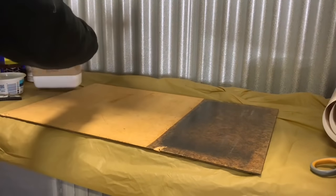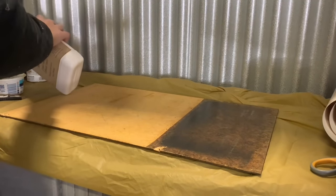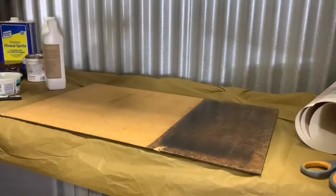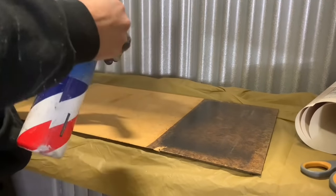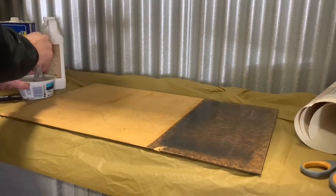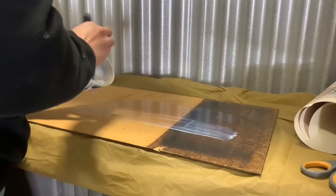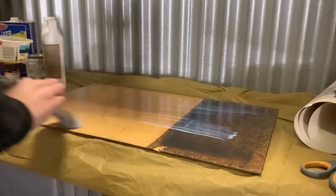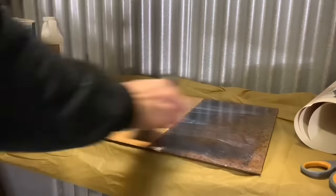I use it with my Chalk Mountain satin poly — that's how I apply it. If you want to use wallpaper paste you can totally do that too. You just make sure you do a thicker layer of the poly and you might have to go around the edges once it dries because the edges want to pull up. But once you do it a second time to hit the edges, if they didn't stick down they won't come up. You're going to be totally fine.